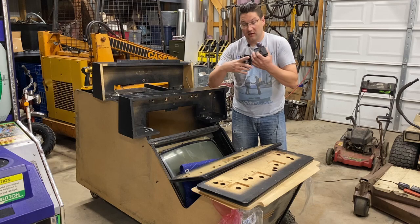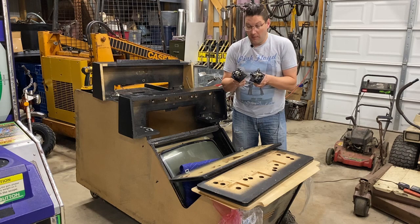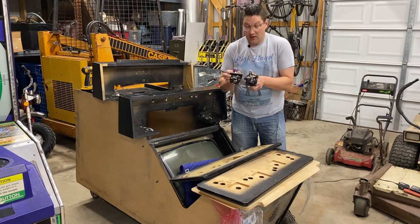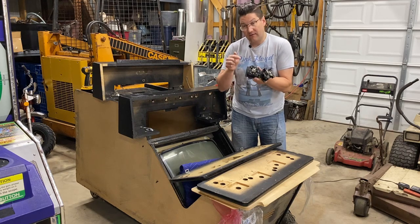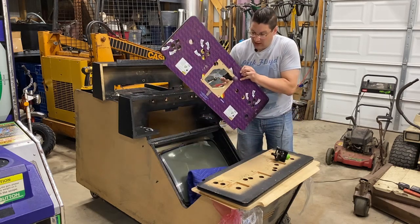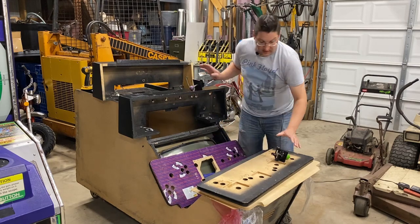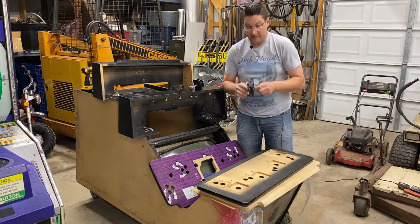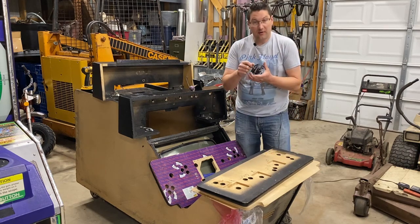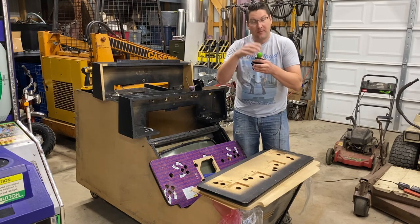Some Simpsons were a leaf spring, some were a WICO Microswitch, but they both were the WICO rubber grommeted bases. And the X-Men is a 4-inch shaft, so it's going to stick through the control panel about the same as you would have on a Simpsons Turtles, because that's a 3.5-inch shaft. This would be dropped down because of the cutout, so it would require a smaller hole, but it would also stick out about the same.